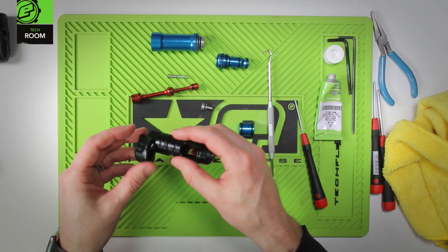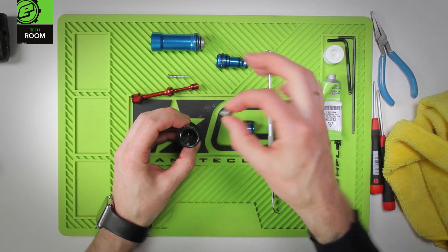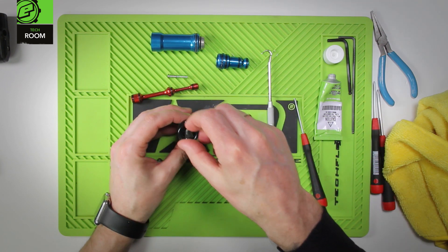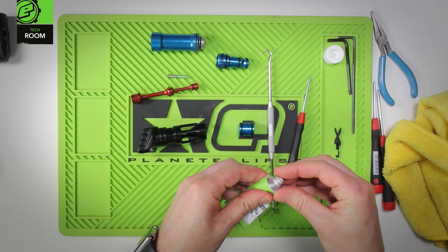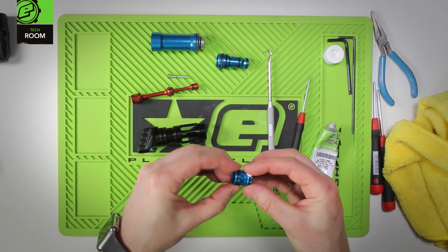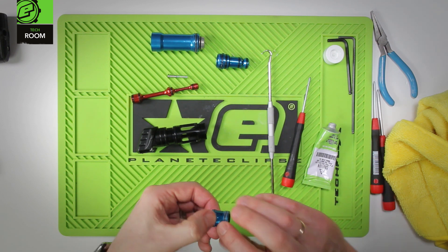Reassembling — we can put the back cap on. The most fiddly thing is dropping the plunger back in; it has to go with the dome face going downwards. Just push that down into place. Start greasing and reassemble. Grease the switch, which has two o-rings on the outside — number 16's on the outside of the switch.